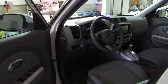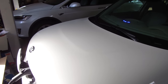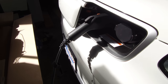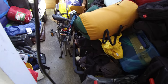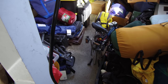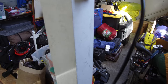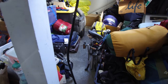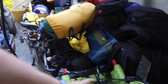This is the actual Kia Soul EV itself. There's not a whole lot to say about it, but I do like it a lot — it's a nice, small, fairly compact car, but it works well. I just want to make sure the adapter is not getting too hot, and it's not at all. I think this is a great solution for anyone who already has a 240-volt outlet in their home. All the wiring here isn't strong enough to handle a 50-amp circuit like a NEMA 14-50, but I already have a 20-amp circuit here. If you have a dryer outlet or something like that in your garage, this would be great for that.